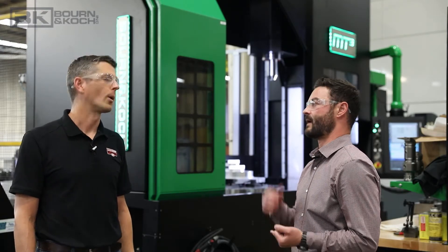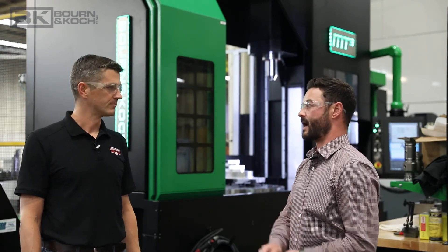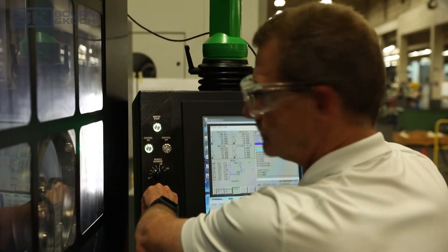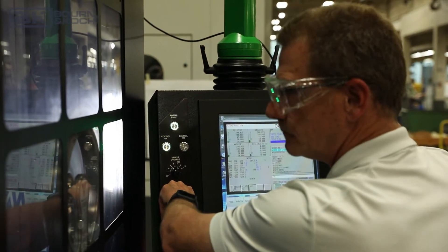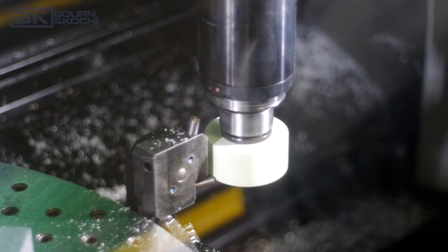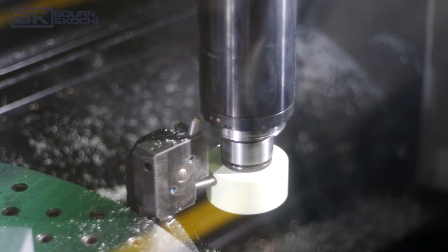How do you program it? You program it through CAM software — we use Autodesk HSM, and we also have FANUC Manual Guide i. And then we also have our own conversational human-machine interface for doing the grinding cycle. So if you're doing ID and OD grinding and your dressing cycle, that's all programmed conversationally. You can see on the front edge of the table there's a small dresser there for doing the bottom face and the periphery of the wheel, so you can still dress within the machine.